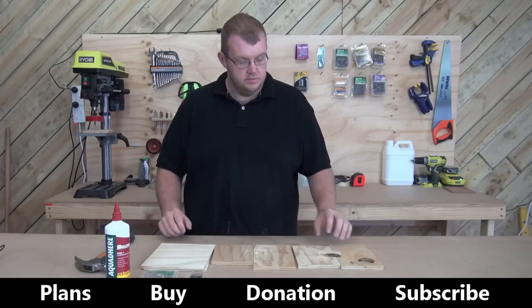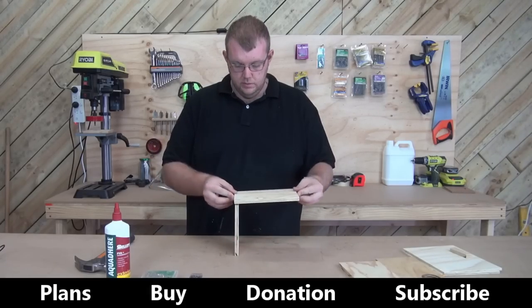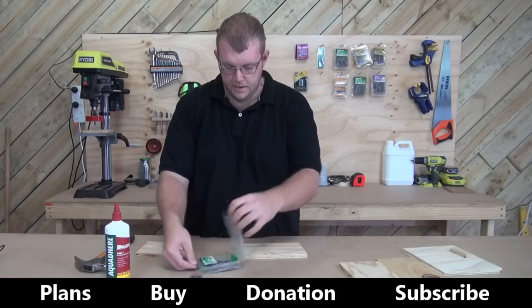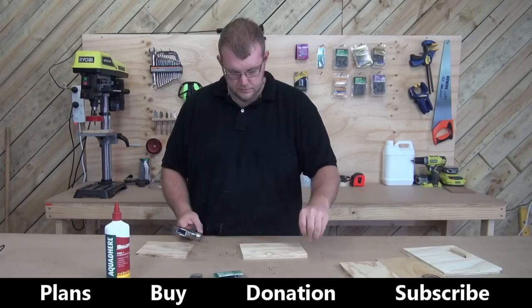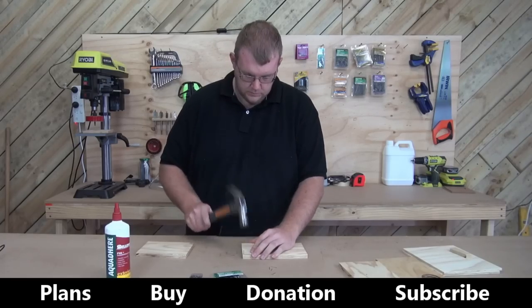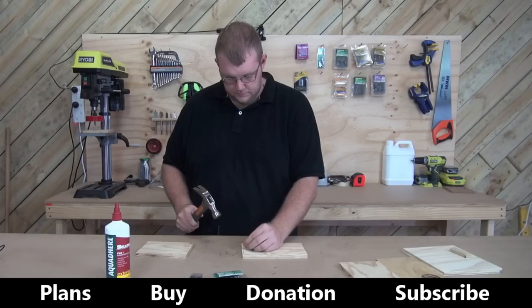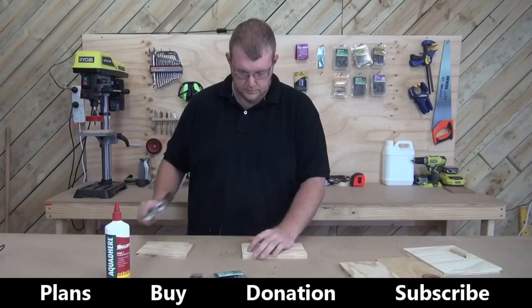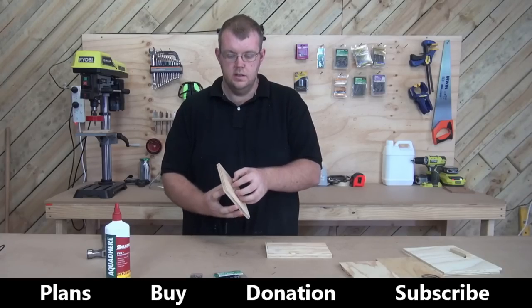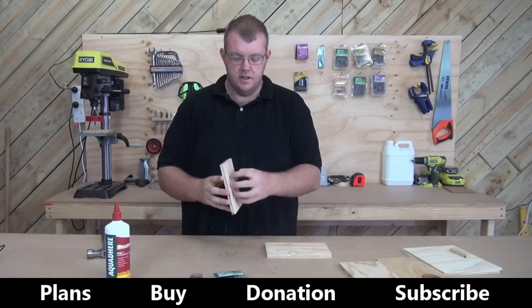Once you've got all the bits, just move some of them out of the way that you don't need yet. I'll start with the bottom and the back — the back will attach on there, so we're just going to put a couple of nails in there for now. We're using the 20mm nails for this. With the bottom, just find which is the roughest side — this is structural ply so you're going to have some rough sides. Keep the rough side on the inside.